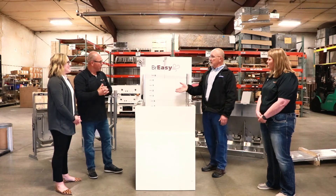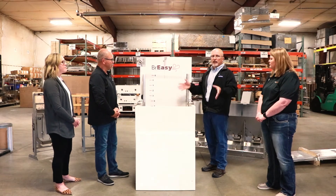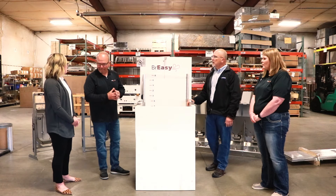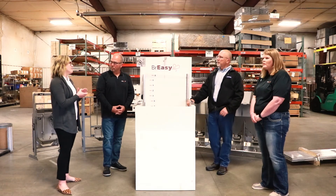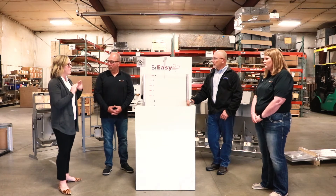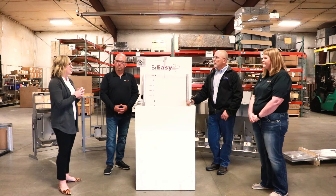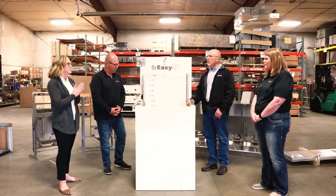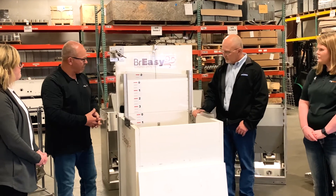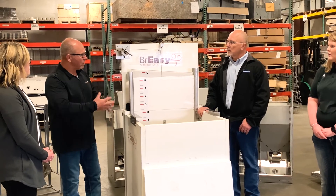So this looks pretty neat. Now, is this easy to install? I mean, if I've got a barn already and I think, hey, Dave, you sold me on these things — I've got to go out and buy eight of them right now — how hard are these to install? They're really very simple to install. We've created an install video, and it was important for us to make sure everybody installing it was really safe. The side rails were developed so you can install them all from above and outside of the pit — there is no need to get into the pit to install it. It's simply just leaning over the side and drilling some holes into your pit wall. Stainless steel rails, PVC panels slide in, and we sell them in kits with the winch and the cables and the rails all enclosed in the kit.